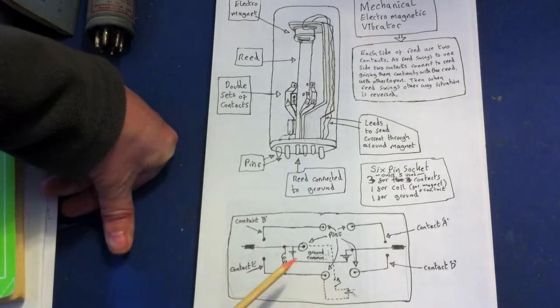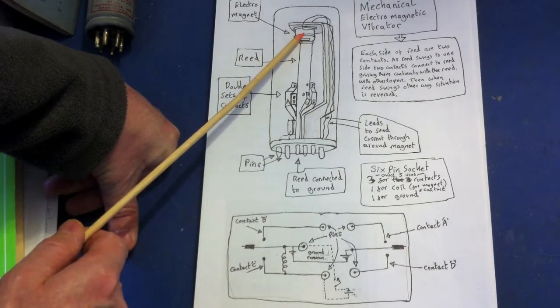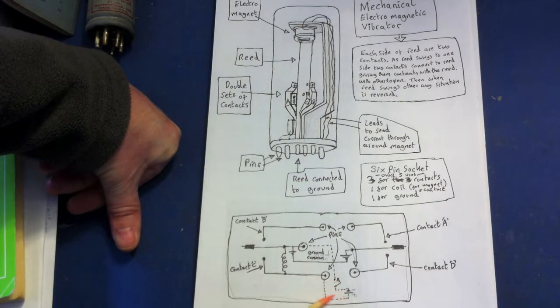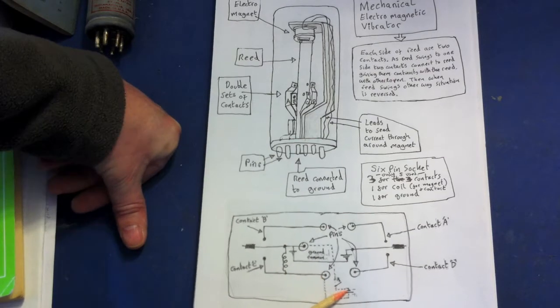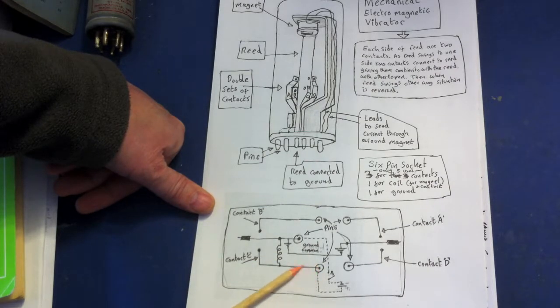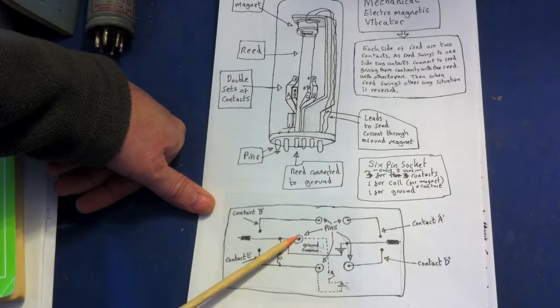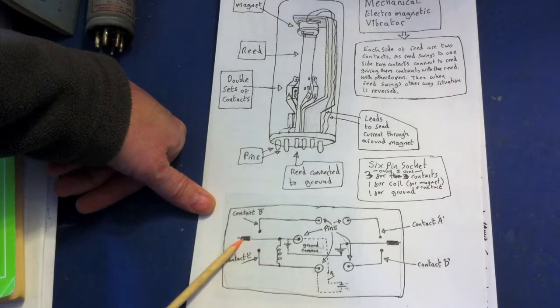Given that, you can see that this pin here is connected to ground and one side of this coil. Let's say we place the battery such that the positive side — we're going to talk about conventional current here — the positive side is connected here, and then the other side is connected across this coil of wire. Charge will flow through the coil of wire and then back down to earth, which is connected to the minus side. Once you connect that battery you're going to have a magnetic field around this coil of wire — you've turned this coil into a magnet, and because you've got a piece of metal here, due to magnetism the metal itself is going to be attracted.